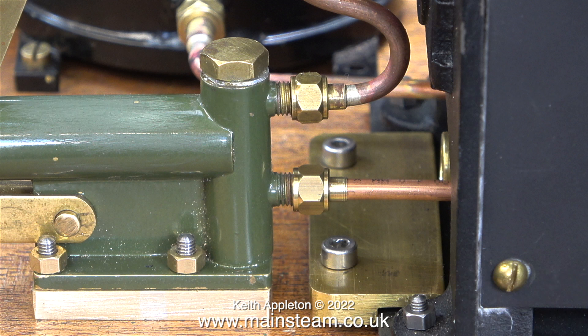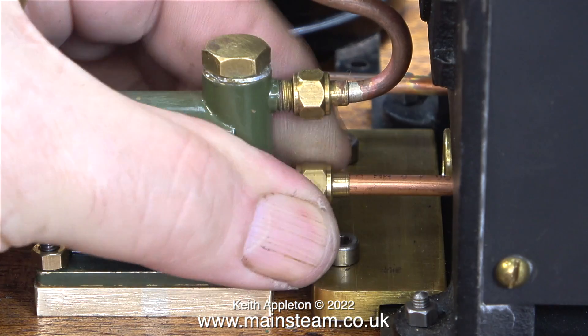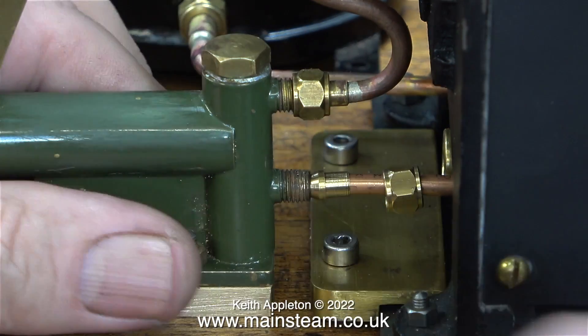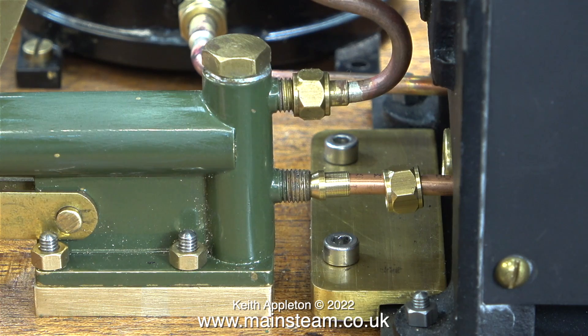The physical size of the water piping is governed by the pump outlets, which are quarter by 32 threads per inch, and these are suitable for 1/8 or 5/32 pipe. I've silver soldered the top pipe; the bottom part is loosely fitted together and I'm removing it.